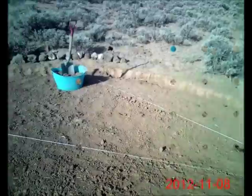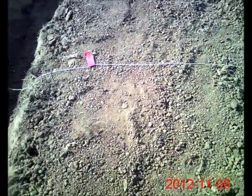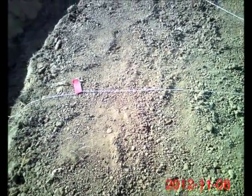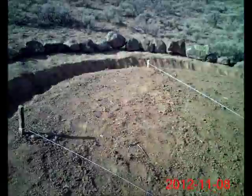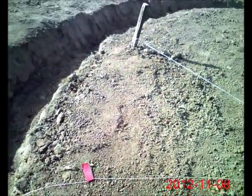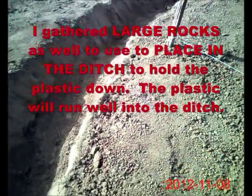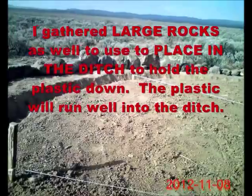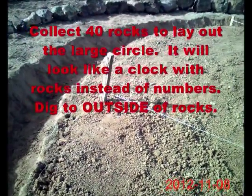You want to choose an area, and I cleaned out the circle — made that red tape mark at eight feet using a tape measure. Then I walked in a circle all the way around with the string pivoting on the center stake. You could use flour, paint, whatever to mark it. You can taper the edge a little bit right along in there, and if you taper it, when the water runs off and hits the plastic it'll run straight down into the ditch. The plastic runs in the ditch, then I'll take those rocks you see along there and lay them on top of the plastic about every two feet to keep the plastic from blowing away.